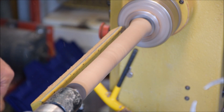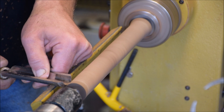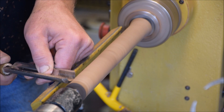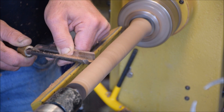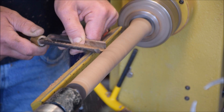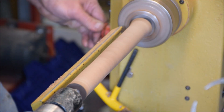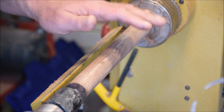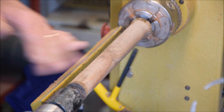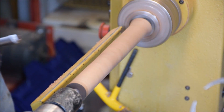Now I'm going to do something that Brendan from Ireland showed me — I cut backwards, introducing the cutting edge and trailing my blade instead of leading. This puts less pressure on your spindle so you don't get as much hop or vibration out of it. Right now it's thick enough that I wouldn't have had a problem either way, but I do have a little splinter piece still right there.